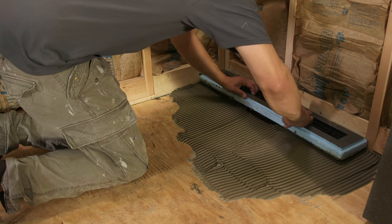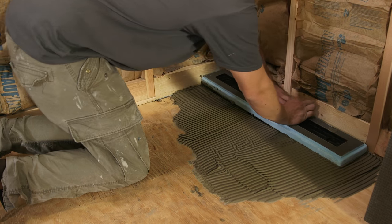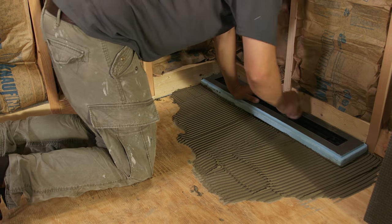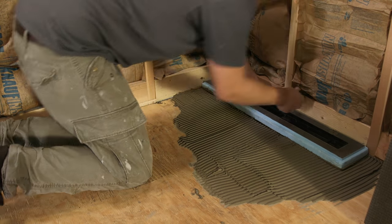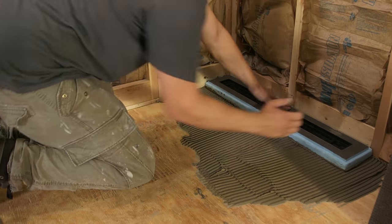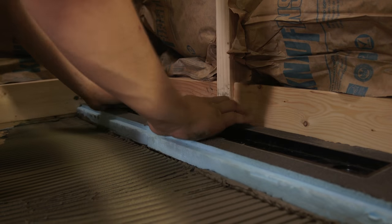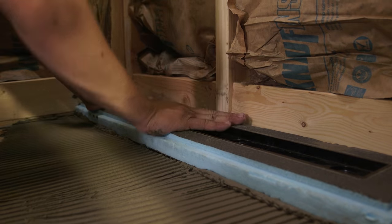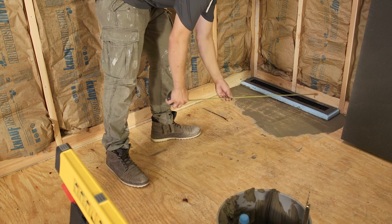The line drain module is now connected to the Wedi drain trap. The rubber sealing gasket has to fit tightly and all the way into the trap. It is a good idea not to fasten the trap's flanges to the subfloor so it may still offer a bit of flexibility and move along with the rubber sealing gasket pushing into the trap. Apply firm pressure on all areas of the panel to ensure good bond. Add some weight equally but do not step or stomp on the panel so critical internal seals of the line drain will not be damaged.